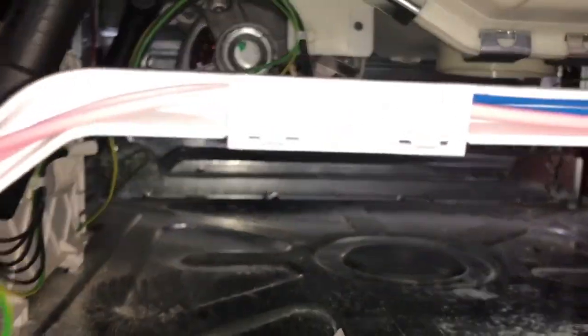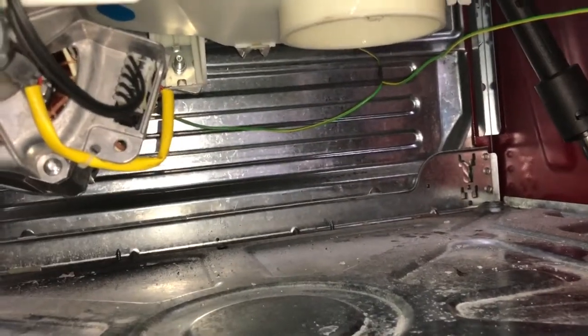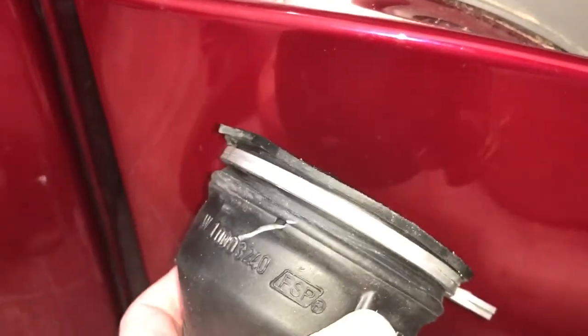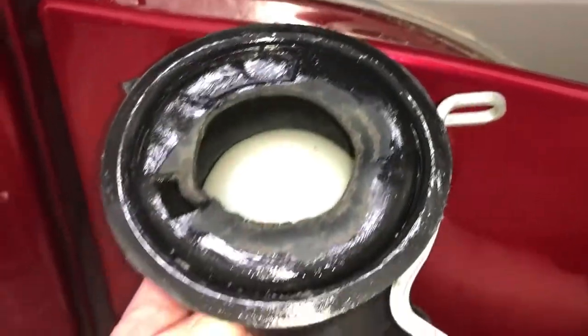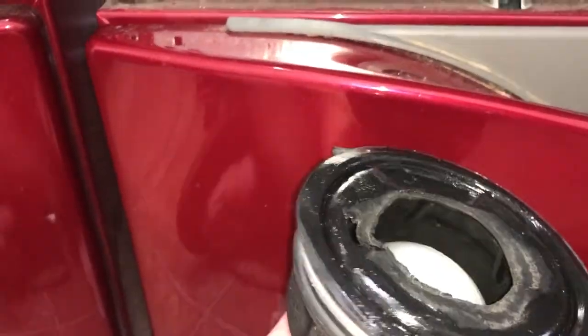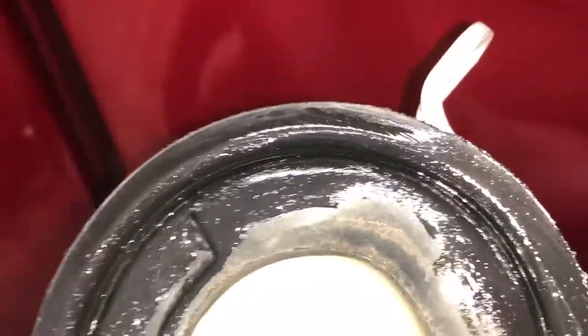It is extremely tight but it is not supposed to be forced — it should just slide in. I can't stress waterproof grease enough as an incredible product. Plumber grade. If it's not sliding in, the rubber is too dry — I'm doing this in winter with almost no humidity. The rubber is almost too hard to maneuver. A little bit of waterproof grease, and I mean extremely small amounts, is just enough to get it to slide in.